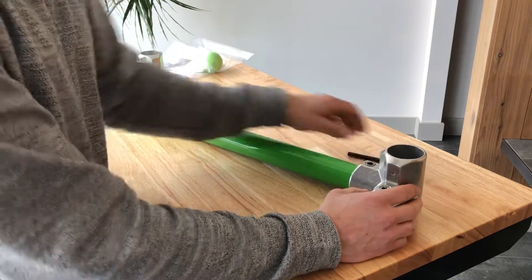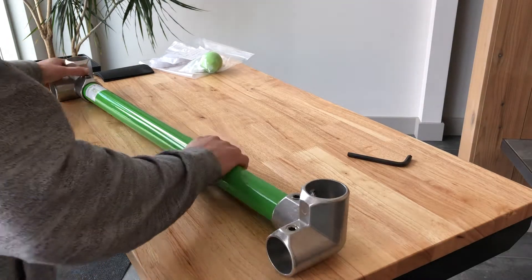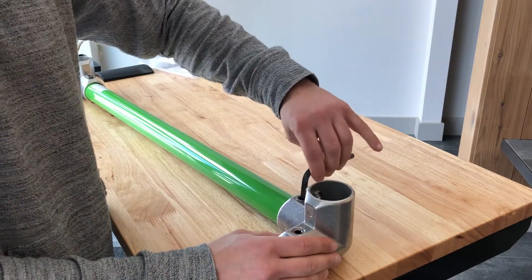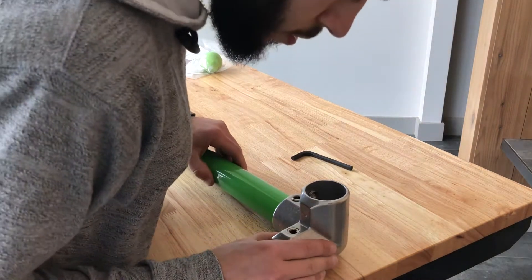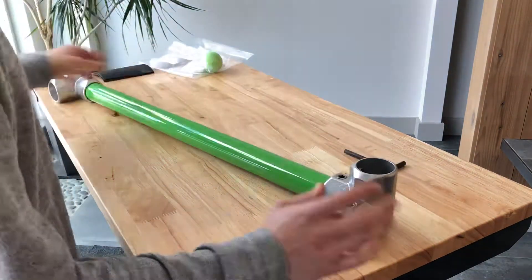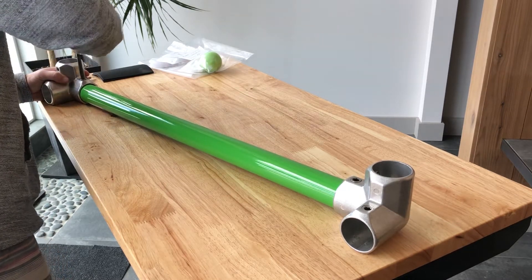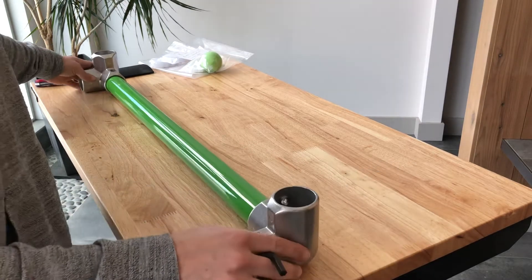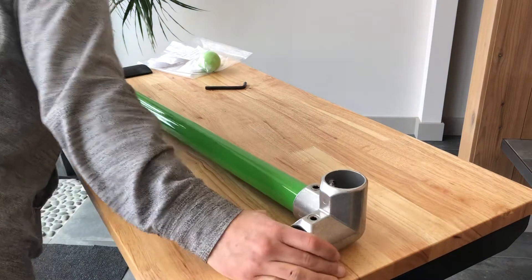Tighten that down until it makes contact with the beam. Don't tighten it too much. The two screws that are up are the two that you're gonna use to put the beam in. Before you make contact with the beam, rotate it so the sticker is facing up. Check in and make sure it's flush. Adjust it so the screw just contacts the beam, and then same thing on the other side. Make sure the beam is flush in the coupling. Now we recommend making gentle contact with each end and then checking how your alignment is. What you don't want is for the two beam ends to be misaligned — when you put the beam down it rolls. Make sure both ends are flush.